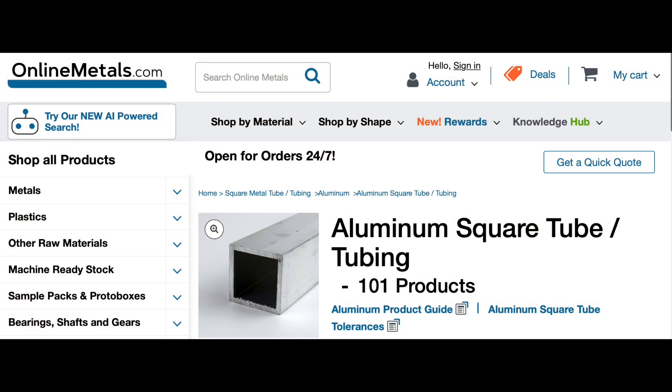I'm going in tomorrow to work three or four hours on the Horia bit project to make sure I'm at least on par with where most of my class is on it. Now, I want to show you our very first class project. We started with square aluminum stock, then used a hacksaw to rip it in half to make a nameplate for our workbench. This was basically a Trojan horse to learn our body's biases. When you file, you naturally tend to tilt the file either upward or downward, leftward or rightward — this stems from how your joints are constructed, how your muscles are working, and which muscles are slightly stronger than others.